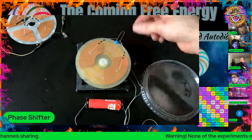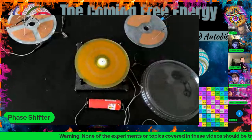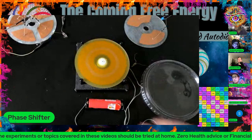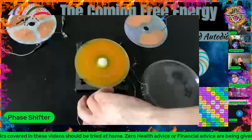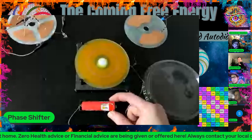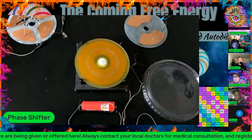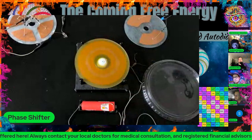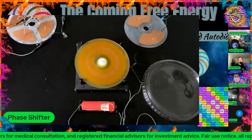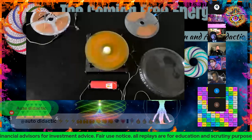How much does it increase your load on the motor that's spinning it whenever you have the inductance going? From the test measurements, it doesn't increase it at all. Wow. And that's what I'm still trying to figure out is, where is the actual energy going? We know that it takes a certain amount of energy from the brushes, the frictional contacts, and the air being produced in terms of motion from this rotating disc, powered from a DC supply. All that's going to take energy. That's mechanical losses. We're moving air. We're producing sound. The motor is increasing in temperature because it's just simply rotating with no power being drawn from it, with no upper disc or anything.